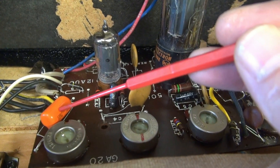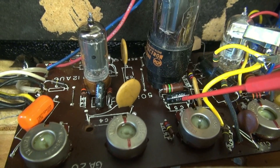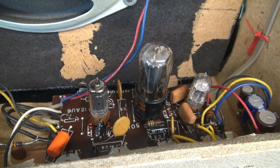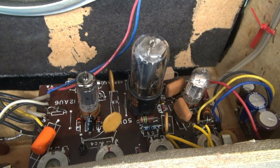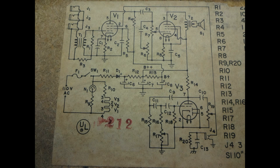The black beauty has been replaced with a Sprague. Now I'm going to do these two little guys here — you can see these are one-microfarad caps. According to the schematic they're supposed to be 25s, but I don't see any evidence they've been changed, so I'm just going to go ahead and put in 25s. All right, so all the new caps are installed and the new filter cap assembly is securely mounted. Next step, let's hook up a guitar and see how she sounds. If you end up with one of these little Delray amps, the GA-20, you'll find the schematic is difficult to find — so here it is.